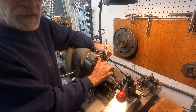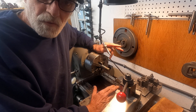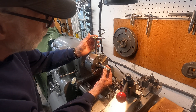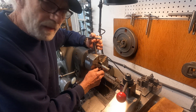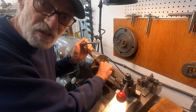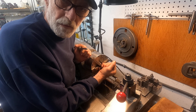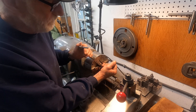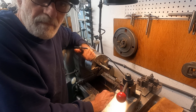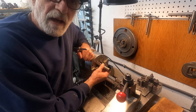Here's a trick: when using six-jaw chucks on grinders where things need to run very true, rotate the work against the tightening torque. All this scroll mechanism has slop, so you want to push that slop in the direction it's going to be pushed anyway — that helps keep it true and prevents shifting while you're using it. Shifting is a real problem, especially on a machine like this. Scroll chucks can expand at 2000 RPM — I demonstrated this with a bushing that actually moved in the chuck.